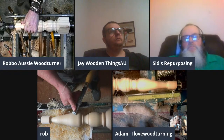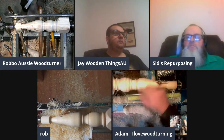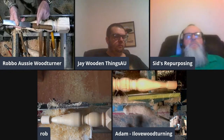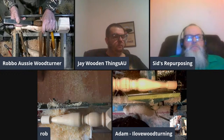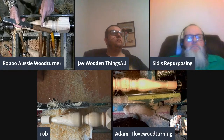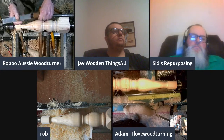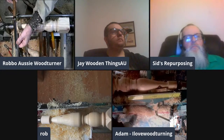Yeah. All right, just stop for a minute. Right. You see this thing on the end of a chisel is called a handle. Yep. Relax. When you're using the skew, relax your hands a bit. Trust me, you are not going to squeeze any more moisture out of that unless you're a tax agent. So just hold it lightly. Like this, camera's not far enough, but I quite often hold it just between two fingers when I'm demonstrating so that people can see how lightly you have to hold it to cut.